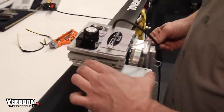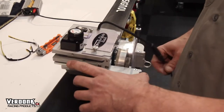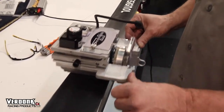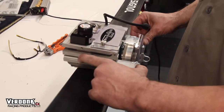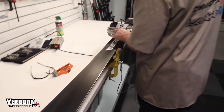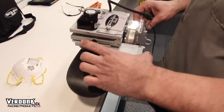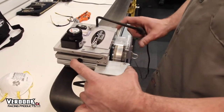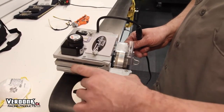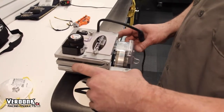The way the snow glide works, you have two trays. This is your clutch, if you will — this engages or disengages the stone. I'm simply going to take the lower tray and push it against the edge. Now you'll hear that the stone is rubbing. Now I've disengaged — the stone is not rubbing. I want to do one pass just to make sure I'm not going to hit anything and my cable is not going to get caught up. Everything is clear. So now, simply with the lever pulled towards me, what I need to focus on is just holding this lower tray. The upper tray will do everything. Try to keep your hands away — try not to push the upper tray. Let the upper tray do its work on its own.